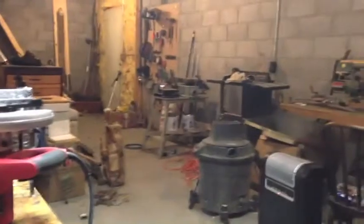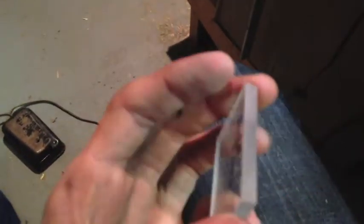Alright, so there we go. I've already sanded that, and it looks pretty good. Right off the bat, it looks like sanding is going to be what we're going with. I got the buffing machine here set up. Really, all I did with this is ran it over the sanding belt and the sanding machine over there. I don't know what that is, it's like a 120 maybe. And then on some 150 grit, I think, paper, and then 320. And it's pretty good. Just real quick, rough sand.